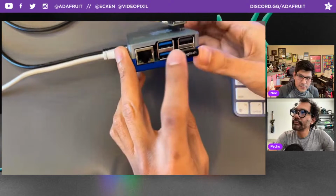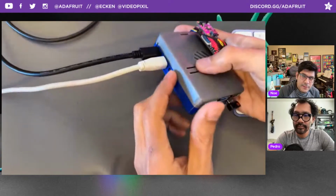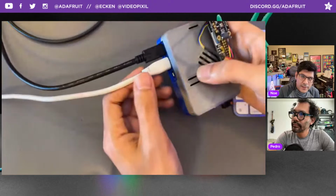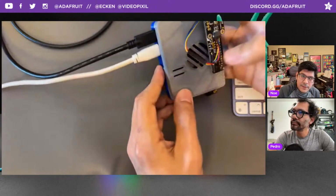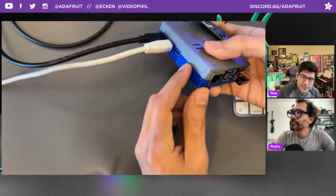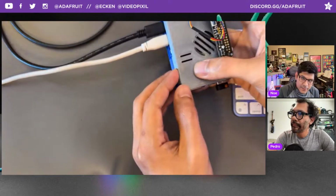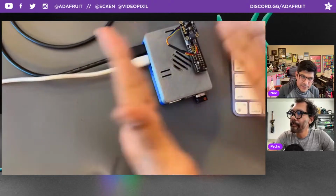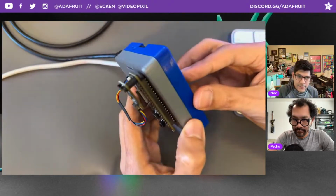These aren't really an issue. The USB ports, they just kind of are out there and exposed. So those were nice, but this was important to make sure that it was right. So that works well there with that indentation. And it's indented because in order to get the snap fit nubs to fit in there, I had to spread this out a bit more. So the case had to be a little bit wider so that there's clearance for those snap fit nubs.